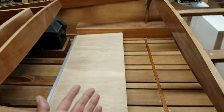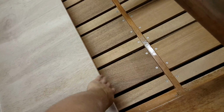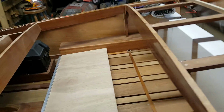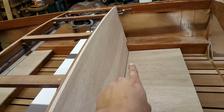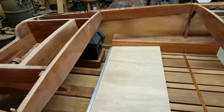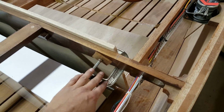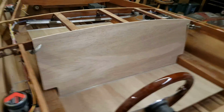And the bottoms are the exact same measurements. I left them overhang about a 1/2 inch. But the bases are exactly the same, front and rear. The cutout should be pretty much the exact same where it's cut out for around the armrest. The overall width should be the same, but the height will be different on the rear seat. It is shallower, not as deep. But I haven't got any of the T-nuts in here yet. Obviously, I've just got the seat back clamped in place, but we're making fantastic progress. It's turning out very, very good. Very satisfied with the look.